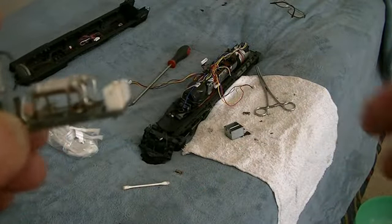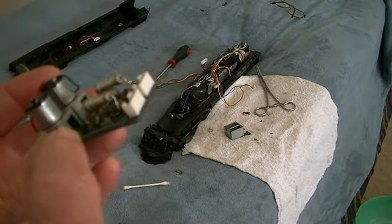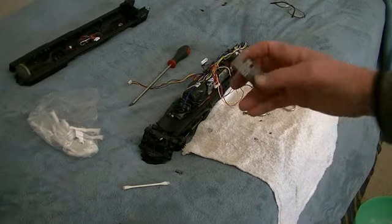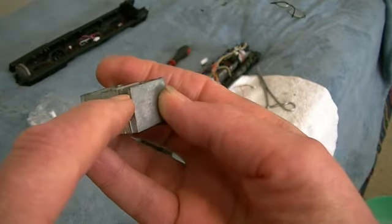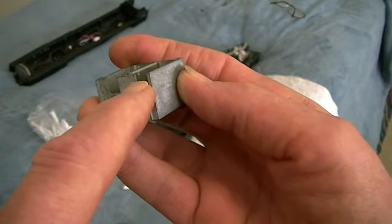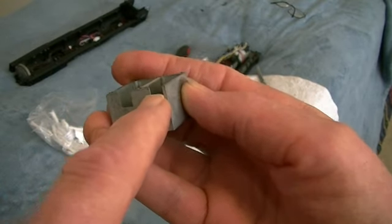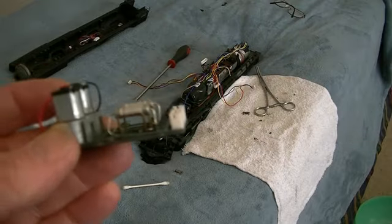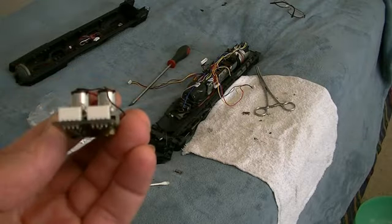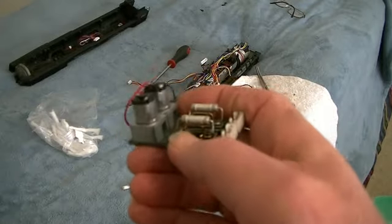You have to make sure there's enough air. Here's where the fan motor pushes the air out, and then there's an opening right there in the reservoir where the air goes through. If your batting is stacked up too high to get to that element with the short legs, it's going to choke off the air, and then you get less smoke volume. Denser smoke, but less volume, so I didn't want to do that. I decided the way to do it would be to replace the elements and make these legs longer. Hopefully it'll work out okay, and we'll know once we try it. I'm going to put everything back together and be right back.